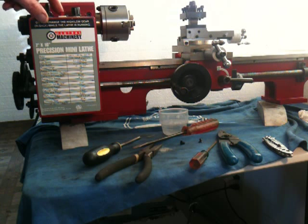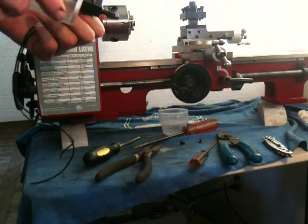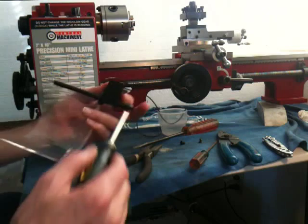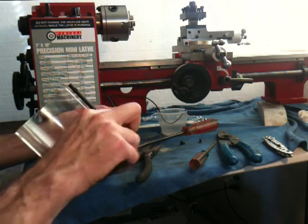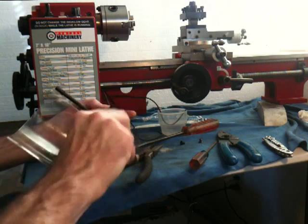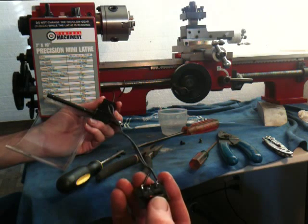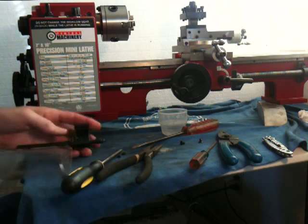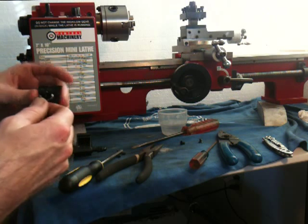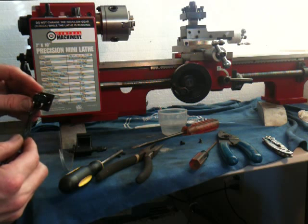So for now, the rest I believe is cosmetics. I will put my splash shield back on after I remove the micro switch if that's possible — I see three little screws, so let's take that apart. Little bitty short cheap metal screws on that micro switch — but since those are no longer necessary, I think I'll leave that on the backing plate. I might find another use for this micro switch — if I ever get crazy enough to build a CNC table, it would make a nice little limit switch.